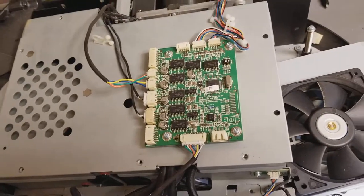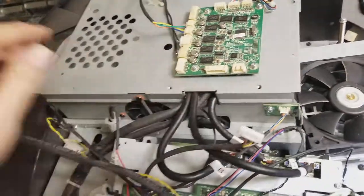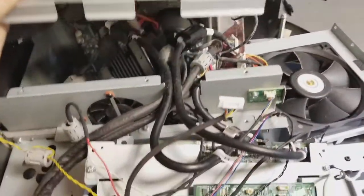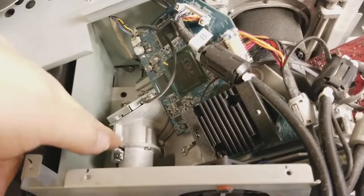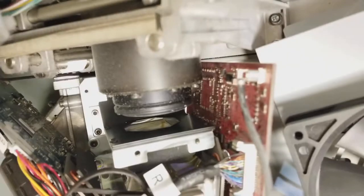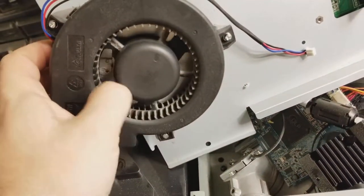There's the translation board for driving other fans and the lenses, and then there's a whole 3-DLP section. This is quite impressive — three DLP chips. The light comes in through the integrator tunnel, goes off that mirror, then gets split up to feed all of the chips. There's a chip on here, a chip on here, and another one. They come out through that combiner piece of glass and then out through the main lens. This needs a pretty reasonable cleaning, but it's not too bad — seen much worse. This fan is pretty dirty, but I've seen fans where you can't even see the blades, they're so clogged.